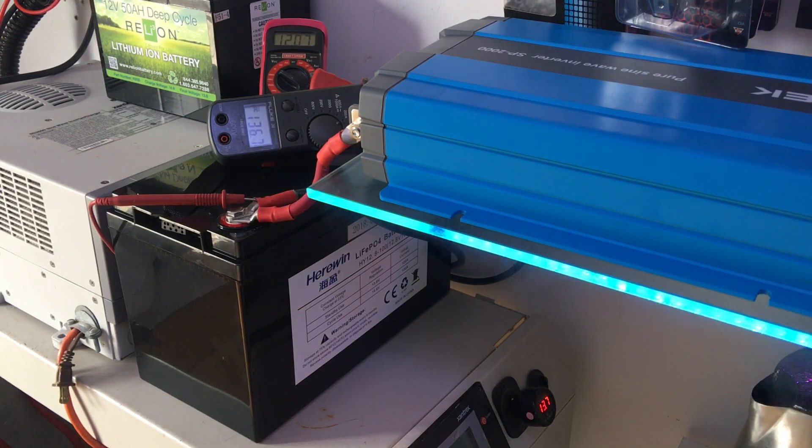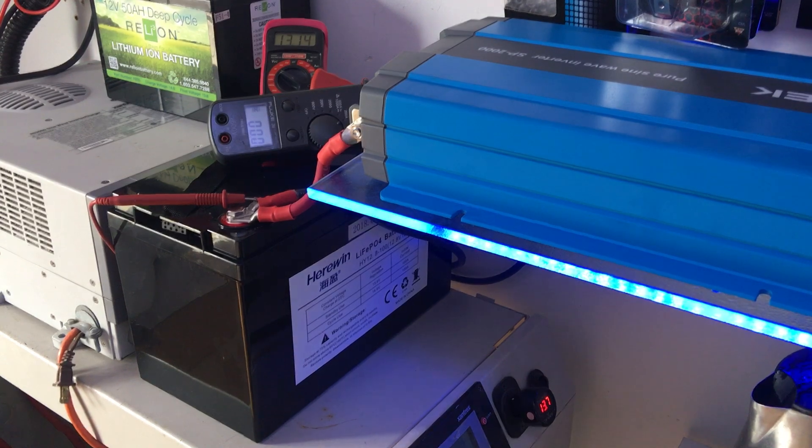What we're going to do now is turn that off, and you can see the battery voltage is going to bump back up super fast — going back to 13.1, up to about 13.2 pretty fast, and that's totally disconnected from any input. The battery did that alone. Price on these batteries is coming way down, and that is a very good thing.